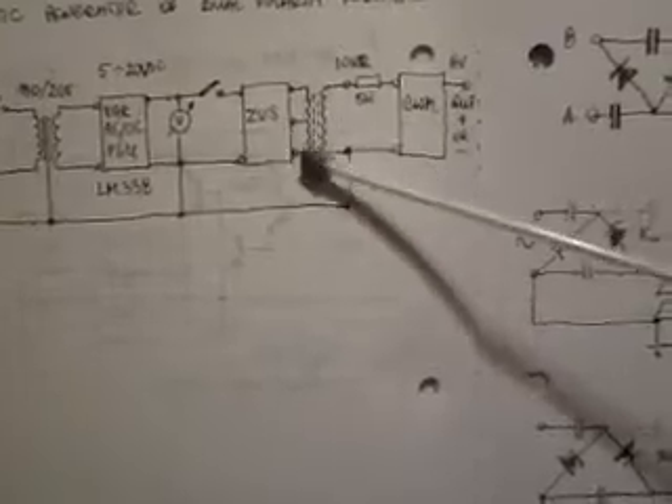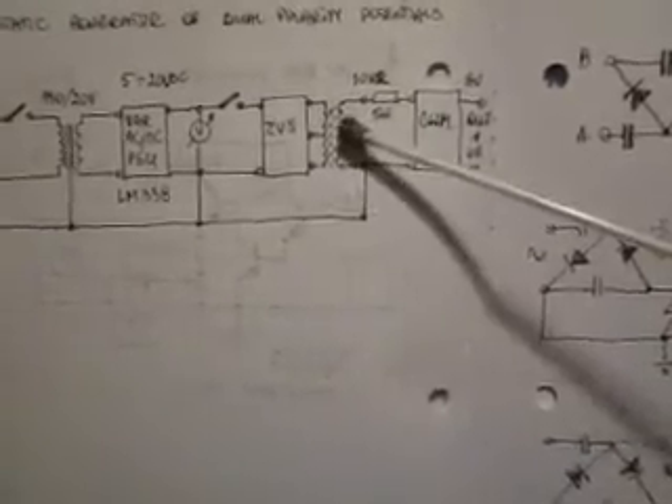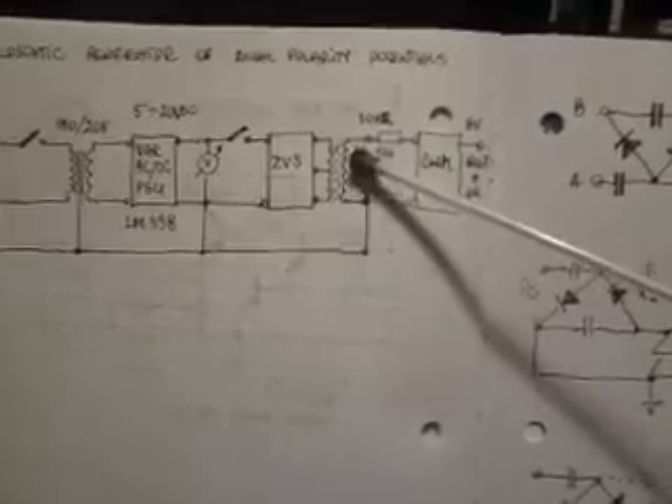Without any problems, this way I can regulate the ZVS input and at the same time adjust my high voltage output. I use the core from the flyback transformer and put my own primary, which is two times five turns. For the secondary I use 26 AWG wire — 17 layers of 20 to 25 turns, and each layer is insulated. You could get the same with a flyback transformer just by winding your primary and using the secondary intact, but I couldn't find one without a built-in rectifier doubler or tripler.